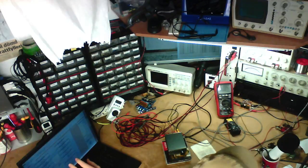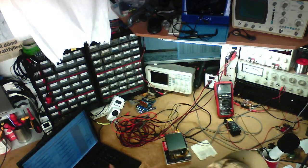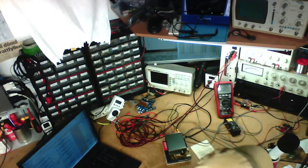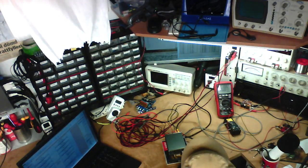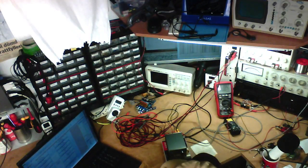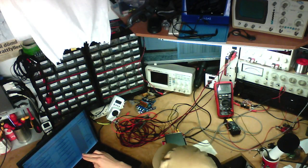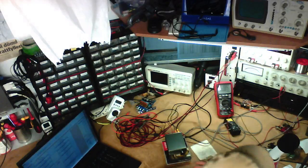In the spreadsheet I'm filling out, my amplifier test spreadsheet, I've got just a lot of different tests for different power levels, essentially. And it's mostly optimized for higher end amplifiers that have ratings like 100 watts per channel into 8 ohms at 0.012% or something like that. And they don't actually give you a clipping power figure. So that's why in this spreadsheet I've got a 0.3% distortion figure, a 1% distortion figure, and then a 10% distortion figure as well, on top of the rated distortion figures. So there's a lot of data that goes into this amplifier test report.